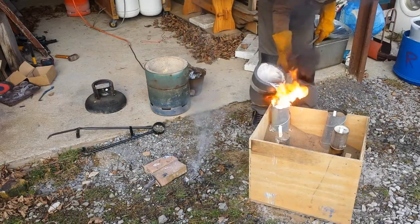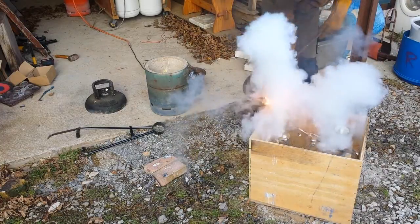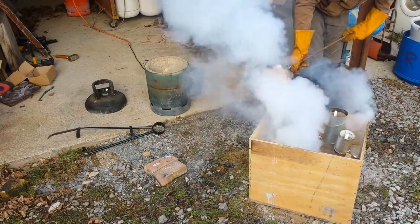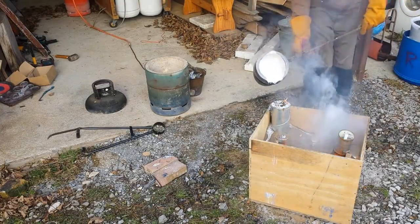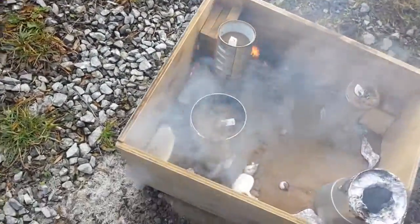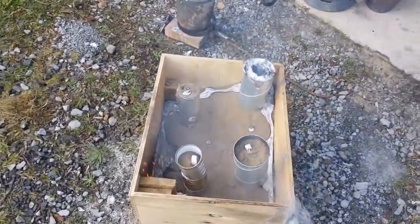This is the first casting that I did in the foam of the gantry end plate — it's quite big. You'll notice no steam coming out of the risers until suddenly there's a lot of pressure, which indicates to me that the exhaust gases didn't really have anywhere to go, building up a lot of pressure. In fact later on I realised it actually blew one of the risers off, and aluminium melted somehow through the sand to the side wall of the plywood. There were some issues down in that corner where aluminium just totally leaked out everywhere.